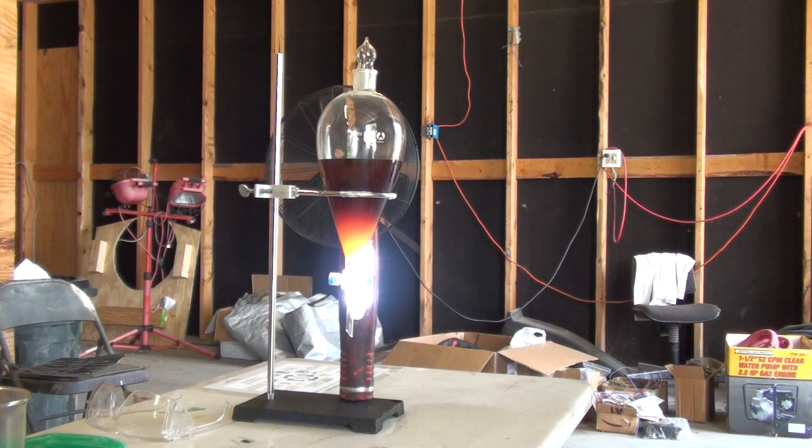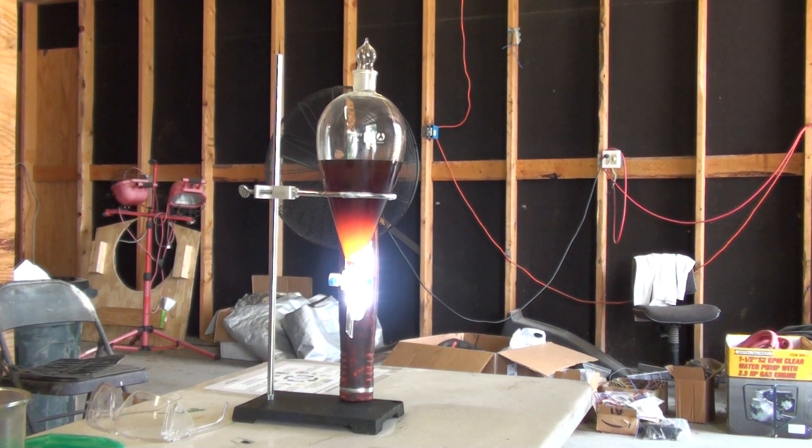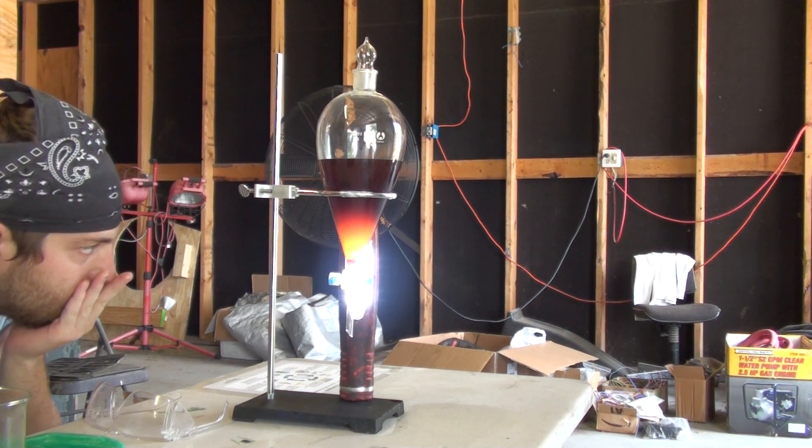So if this doesn't meet the specification for glycerin — which is really the only specification we're thinking it might not meet — we need to get that pressure up to the point where our pump can't make any more pressure. If that doesn't do it, then it'd be multi-passes. We wouldn't want to do multi-passes until we totally max out one pass. That looks like our biodiesel at the bottom there — I assume all that stuff falling is going to build up and all the glycerin's going to build under that.